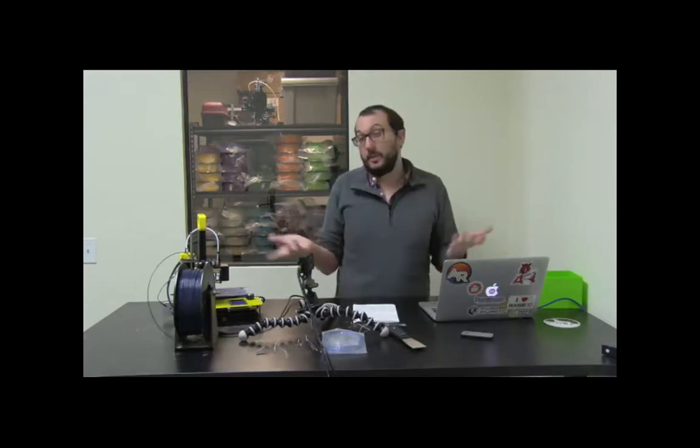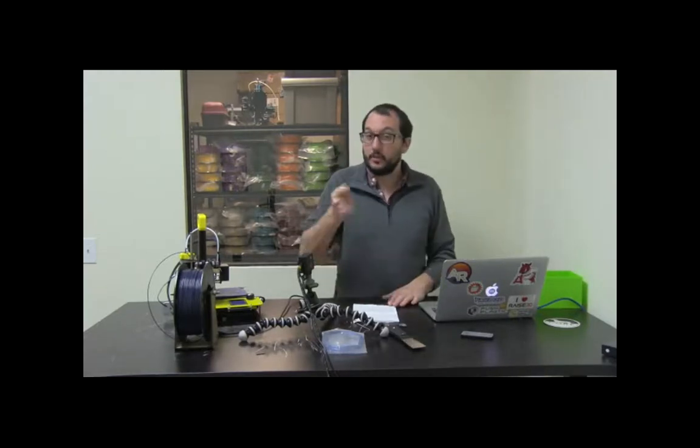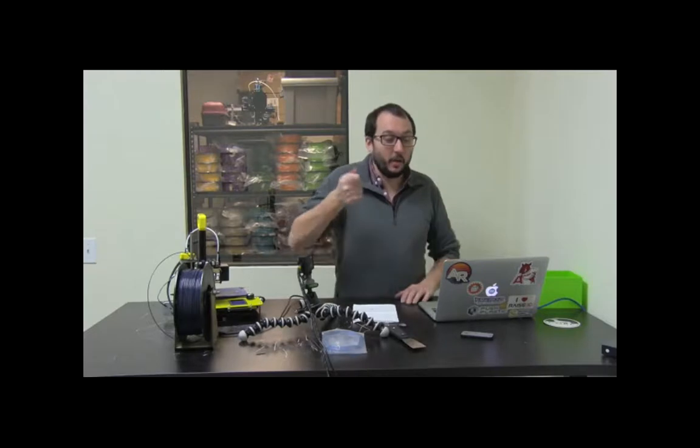If it stays heated inside that funnel and it's not pushing through, it's just going to bake all that filament that's inside of there. It's like burning something in the oven. Because it's made from corn, it's going to turn into carbon. And that is when you'll have to do those soft pulls and try to force the filament through using the filament unclogging tool and stuff like that. So just having the printer off when it's not being used is the best way to prevent that. Whatever 3D printer you have, if you just turn it off when it's not printing, you can prevent that. You don't want to leave it on and heated for more than a couple minutes, because otherwise it can definitely start to cause some problems.